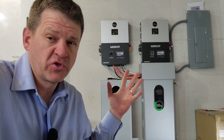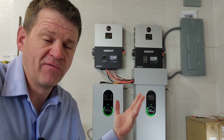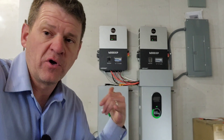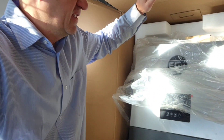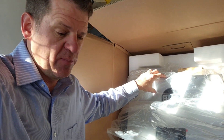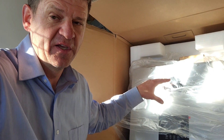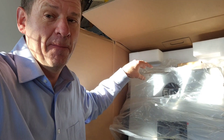I got this system from Signature Solar — they've been great to work with. If you've got questions on sizing your system, what kind of inverters or batteries you need for your house, give them a call. They'll help you size your system and help you order it. I do have affiliate links in the description. But look what we have here — this is our new toy, this is the 12K PV. We're going to be taking out the 6,000 XPS and sticking this single inverter in its place. This unit has a surge capacity of 16 kilowatts for half a second, and supposedly it has a really good surge capacity — I'm going to test it out.